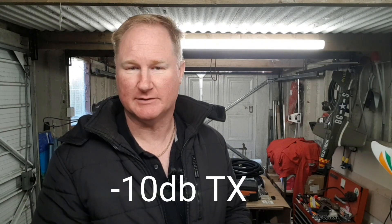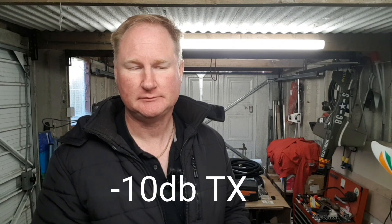Basically I've built myself a 10 dB attenuator. I've done one before but this one's a little bit different. This one is now going to be automatic, so it takes 10 dB off the top of the signal, and then on receive it switches itself out so we've got full normal quality of receive.